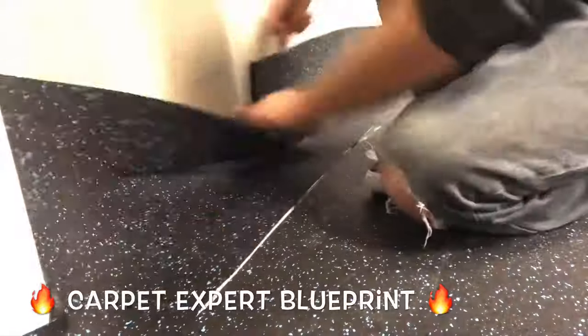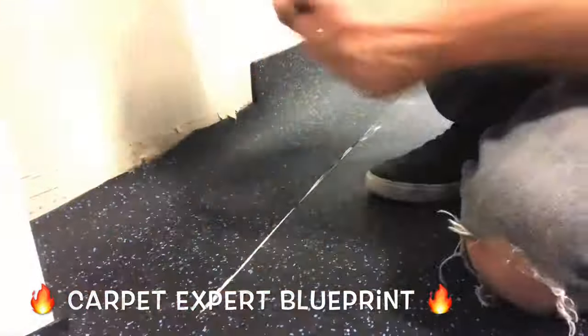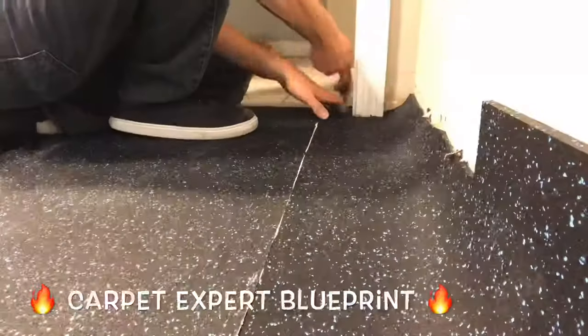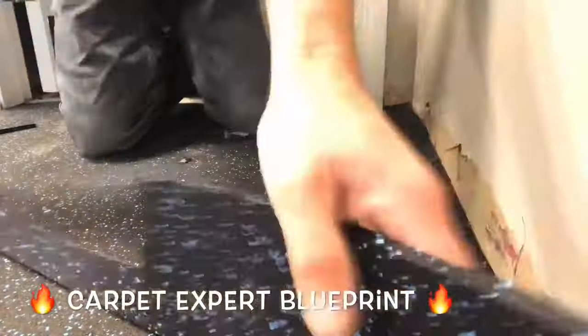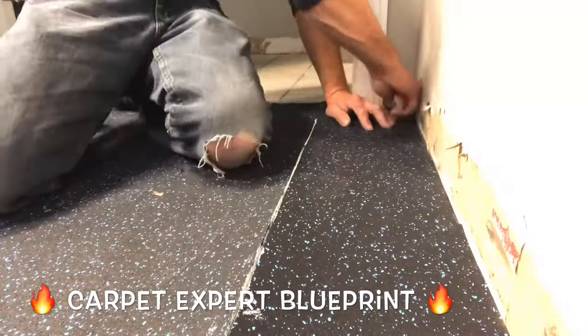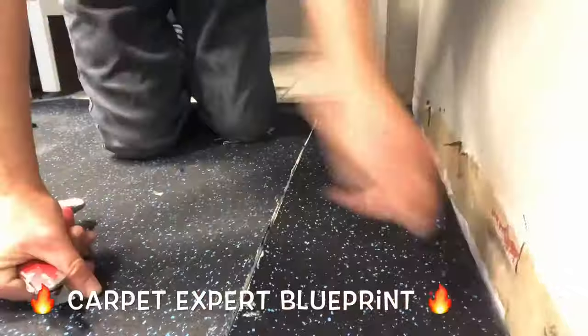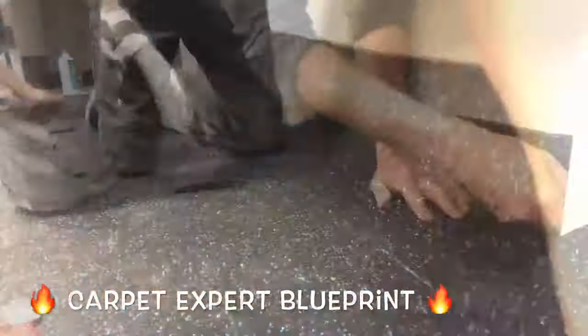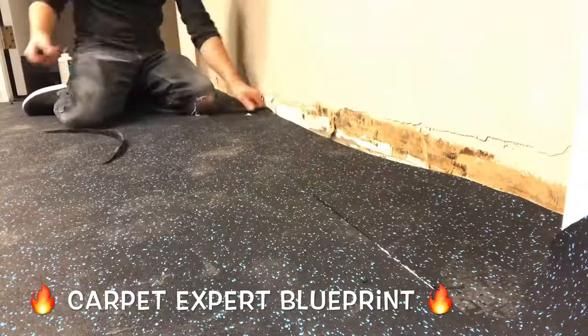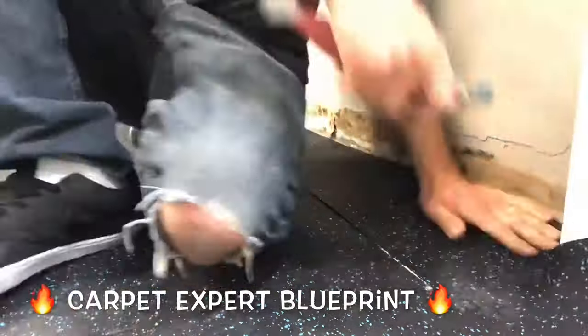And the other thing: glue on the seams. It does not take much to get the glue spurting out the seams there, so you've got to be careful. But you can just take the edge of your razor and run that right along the seam — the glue gets cleaned up and you're good to go. That's really all there is to installing rubber flooring. If you have any other questions, go ahead and comment below. I'll create follow-up videos answering your questions. Thank you so much for tuning in and I'll connect with you on the next.